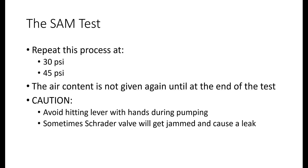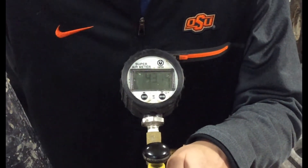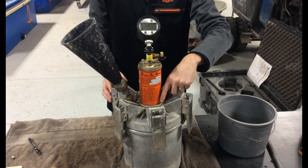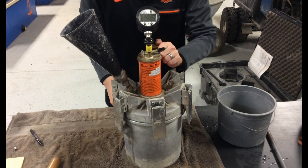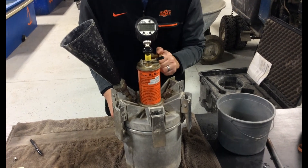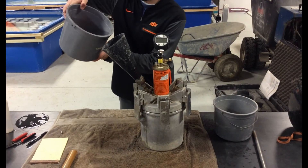Repeat this process and follow the gauge's instructions for the 30 psi and 45 psi pressure steps. Record each of the equilibrium pressures at those steps. After finishing the 45 psi pressure step, the gauge will read purge and rerun. Open the petcock while covering the opening with your hand to prevent water from spraying any bystanders. Open the needle valve and bleed the pressure until it reads close to 14.5 psi — this will save you time during the test. Repeat the filling procedure as previously discussed.